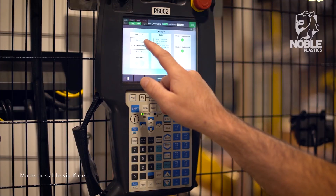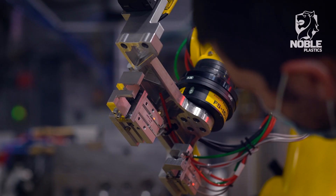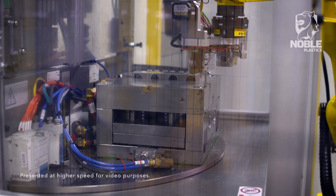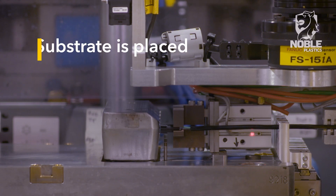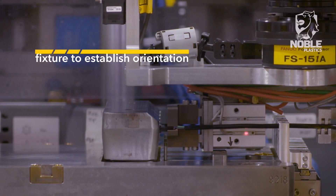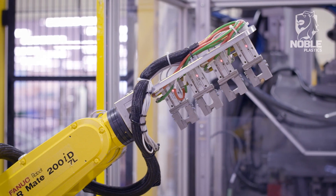Calibration of robot two pick and place positions after a tooling change is accomplished with an automated sequence. Following a mold and end-of-arm tooling change, the user installs a simple probe on the end-of-arm tooling, allowing the robot through force sensing to function like a coordinate measuring machine. The sequence is completed on each mold lower half. In a separate sequence, a substrate is placed in the calibrated mold, after which robot two retrieves the part and places it in the inspection fixture to establish a target orientation used for picking parts. Robots one and three employ common end-of-arm tooling for all parts and do not require calibration.